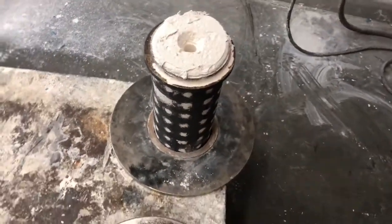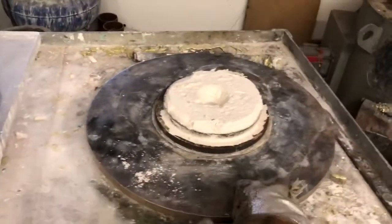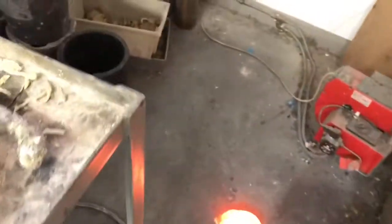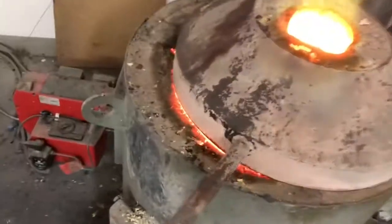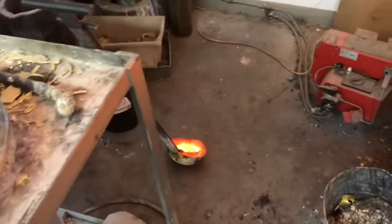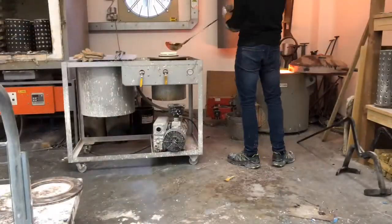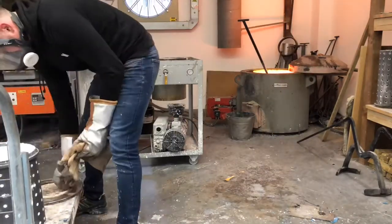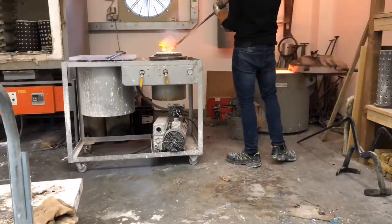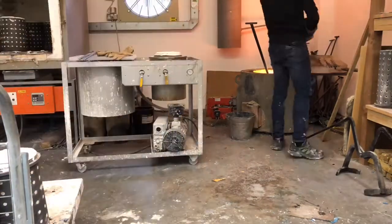Now it's time to put in the last couple of ingots into the furnace. With the oven having done its full cycle, I'll now put the flasks inside this metal ring and back into the vacuum to make sure everything's nice and airtight. These are the ladles I'll be using to pour the metal from the furnace pot to the flask. I'll pour the metal from the pot into the top of the flask through a hole created from melting the wax tree away during the oven cycle. Also, this room is extremely hot — if you stand too close to that furnace without a gas mask you will burn your eyebrows off, which is not a good look.